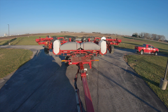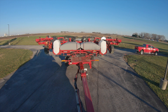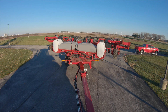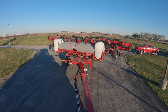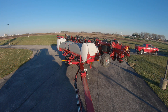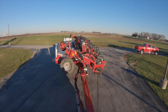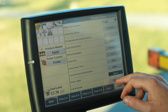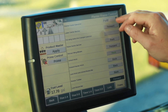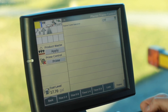We will lock our hitch lock. Rotate our toolbar. Lock or rotate. Go back to the top, select off. This will avoid any accidents with potentially folding or unfolding the planter in transport.